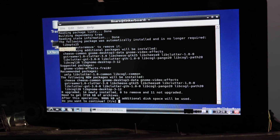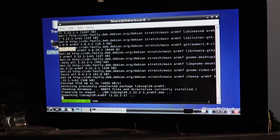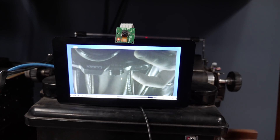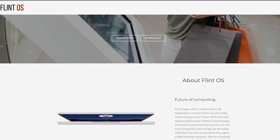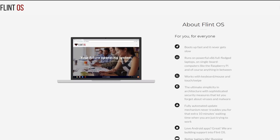For the camera problems, basically out of the box there was no configuration that really supported the Raspberry Pi camera well. I've been using it on and off for about two months with lots of different software images. I was able to get it to work by compiling my own kernel, but if compiling your own kernel isn't something you want to do — it's kind of an involved process — you can compile it on device, which takes a while, or cross-compile on another machine. There is also a full version of Chrome OS — not called Chrome OS because Google — but you can do Chrome OS type things with this single board computer.